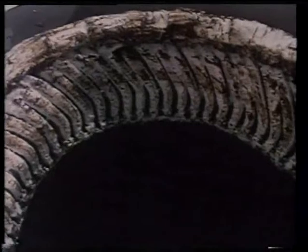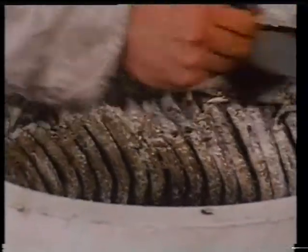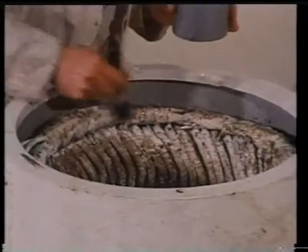If the motor was drenched by seawater, it must first be washed out well with fresh or distilled water to get rid of the salt. Afterwards, clean thoroughly with an approved electrical cleaning fluid to get rid of greasy deposits left after the washing.